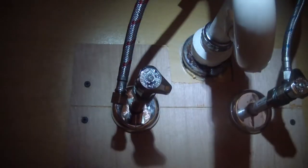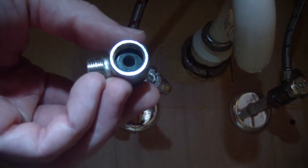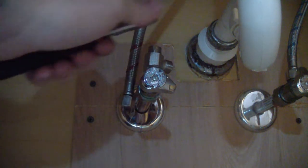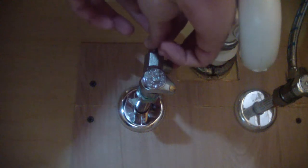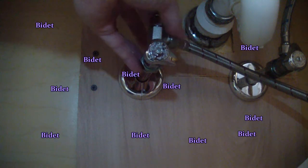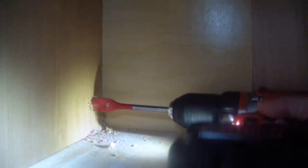Get your T ready to go in the same way. Here I'm showing the gasket that has to be there — I realized I was missing mine and had to go back and look through the bag to find it. Tighten these up and make sure they're aligned correctly in the direction you want to go. Connect the hot back to the sink and tighten that back up. This is the hot connection going to the bidet — you're going to need a long hose for this. Then drill through the side of your cabinet. I went through the pretty side of the cabinet to avoid a gaping hole. Once that's through, clean it out and run your hose through it. That's your hot side. And make sure you clean up your mess or your wife may punch you.